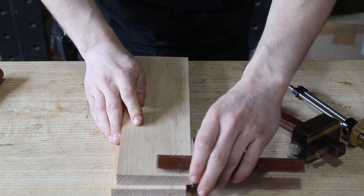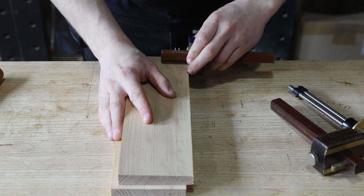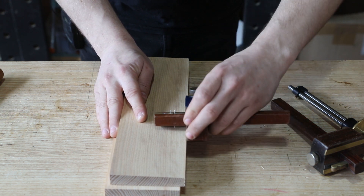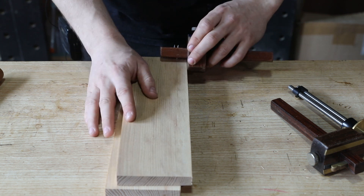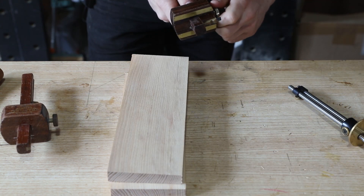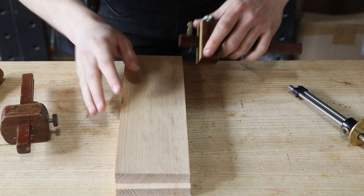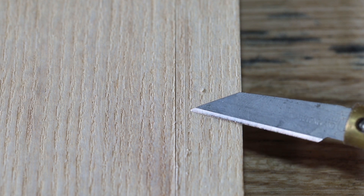Both of these will try to track the grain to an extent - that is just the way wood works, especially with material like this ash where it's a very coarse grain. Closer grain timbers like beech and maple won't track as much, but ash and oak are a bit of a nightmare to mark with the grain. To make it easier, instead of committing to the entire line, start down the bottom, tilt it back, light pressure. Focus more on pushing the stock of the marking gauge into the side of the component rather than down. Start here, tilt back, light pressure, drag it back and slowly move it up the piece of wood - you're creating a track that the pin falls into, so it's less likely to wander later on. Starting at the bottom creates that track early and keeps it consistent along the whole thing.